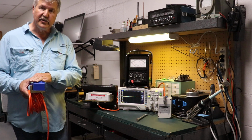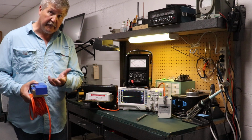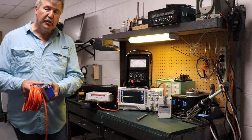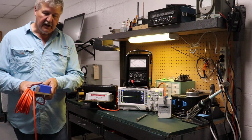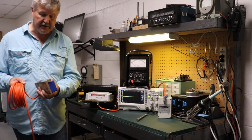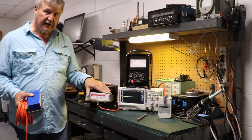That way, if this is displaced from the rail by more than, say, for example, a millimeter, perhaps it's been damaged by on-track equipment or maintenance of way activity, it will provide a fail-safe signal to an axle counting system to ensure that a train can't enter a vital circuit without being detected. So again, vital and non-vital.